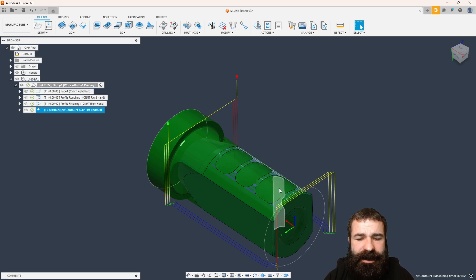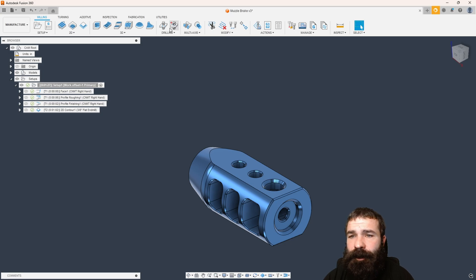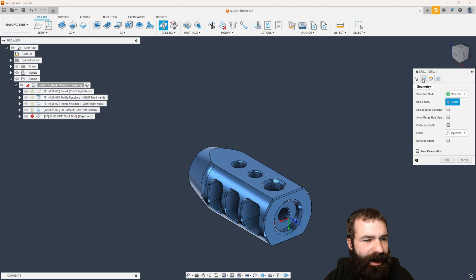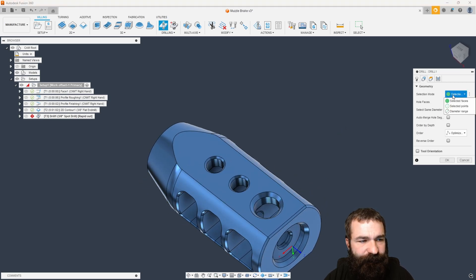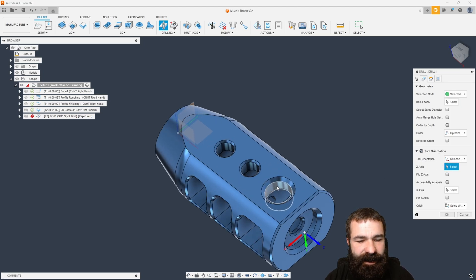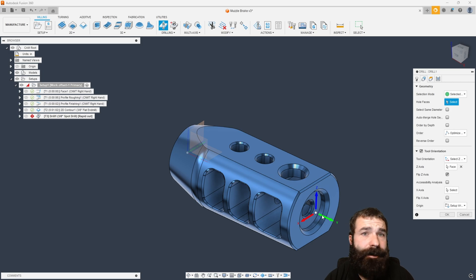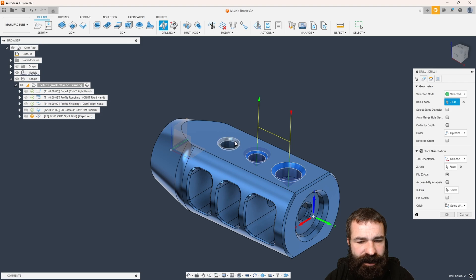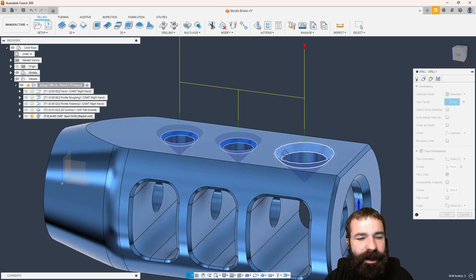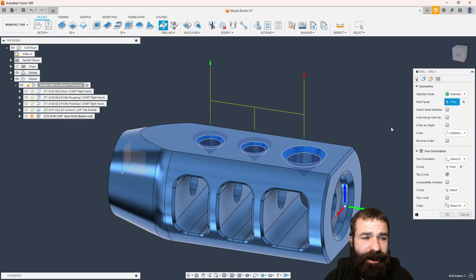With that, let's go ahead and cut our pockets from the side profile. But actually first, I'm going to come up to the top and pop the holes in the top of this. I'm going to go over to my drilling tab, find my spot drill — I do believe I have a nice three-eighths in my library. I'm going to go ahead and pick my geometry, which is the actual face — select faces. I can't pick that face right now because we've yet to set Z to our hole. So I'm going to use the inside of that hole to set my Z there. I did have to flip it up. Your XY may matter on your machine. Now we can actually pick that chamfer surface to create our spot drilling on each one of those. My spot drill for this hole is going to be much too small for the chamfer that I need.